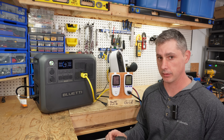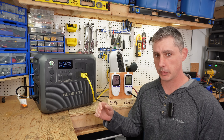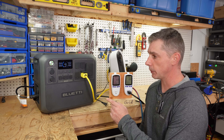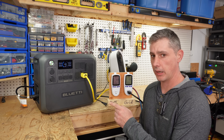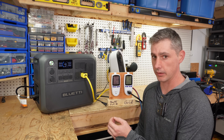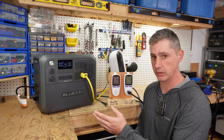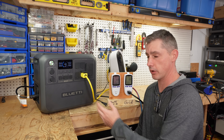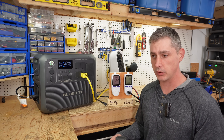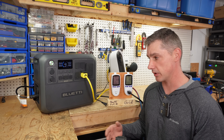We have a time-controlled UPS setting. How does it work? You set your peak time and your off-peak time, and you set your state of charge high and low. I have my unit set to discharge down to 20% and then charge back up to 80%. During peak time, when the electricity bill is highest, it uses battery power until it hits that low state of charge. Then during off-peak time, it runs the load off the grid and charges the battery back up. Over time, this allows you to accumulate a lower electrical bill, which is then going to pay the unit off.